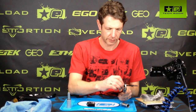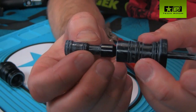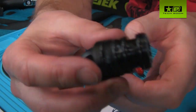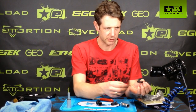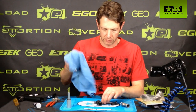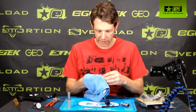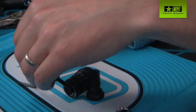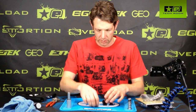Hold on to those two flats and unscrew the valve body from the joiner section. Slide that out. You now have the poppet and the joiner together, and the poppet can just be slid out. Now you have the joiner, poppet, and valve body. One of the small pieces you have is a small spring — this lives inside the back of the poppet. At this point we just want to clean down all the parts, taking off any of the excess grease and getting everything cleaned up ready for reassembly.